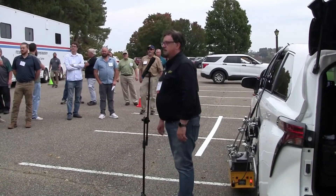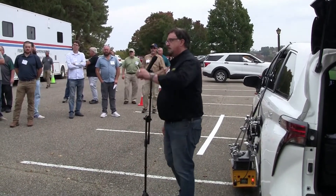Question: How fast does setup take, especially switching sides of the car? So he asked how long it takes to set this up and move it from one side to the other. I do these on rental cars every week — on a brand new car, it takes about a half hour to set up. Once I have it in this position, I take it off in one piece with all the vacuum cups still installed. Putting it back on took about five minutes to get it hooked up and cabled. It has its own calibration block on the front, which is different than any other unit in the world. It takes less than 30 seconds to calibrate, and because of the automated motors keeping it in 30 meter geometry, I don't ever have to calibrate again that day.